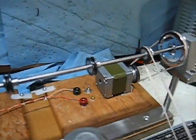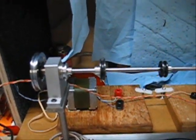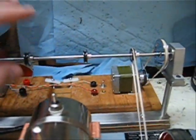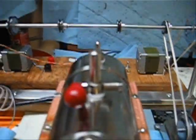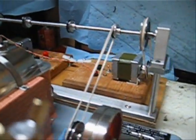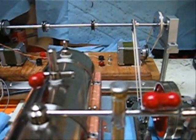Well, here it is — a great big line shaft. It's mounted on ball bearings, which is good for friction, or lack of it, but bad in that it is very sensitive to warping. I was trying to drive it from one of the middle pulleys and it wasn't working very well at all, because the shaft was bending a bit — it's a little bit too long really. Not just that, but if you even tighten these screws down hard, that warps the base just enough to really increase the resistance on the bearings. So it's a very fussy piece of hardware.